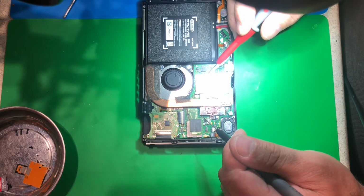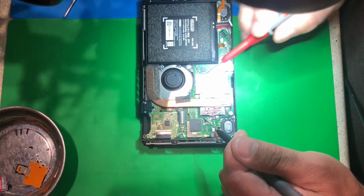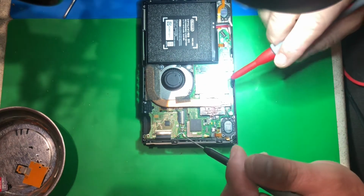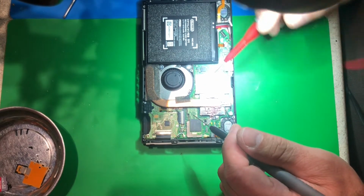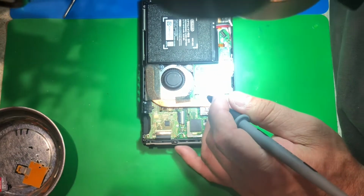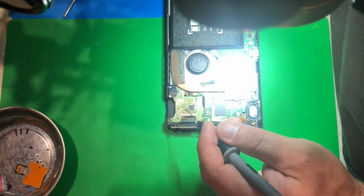So a lot of times on a pad, you can see a little dimple, and that gives you an indication that it's connected to a piece of metal that is going to go down through the board on the other side. On this board, you cannot see that. I guess this manufacturing process doesn't use dimples. So it makes locating the via, especially when you do not have schematics, rather challenging.